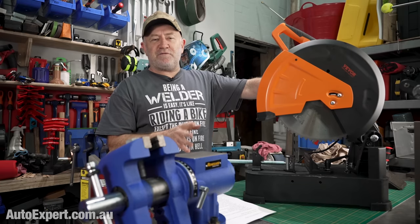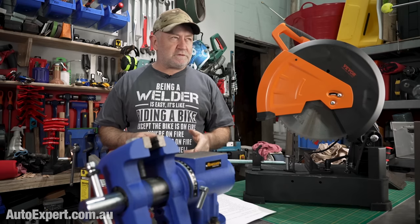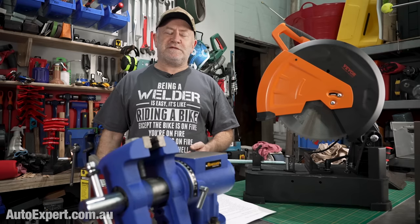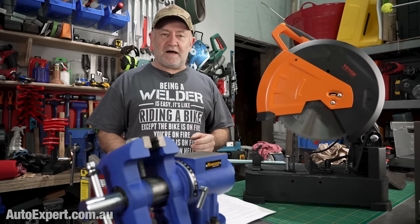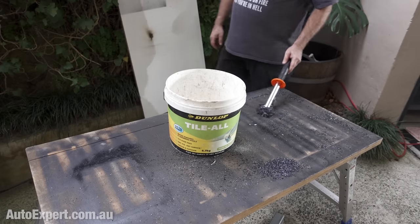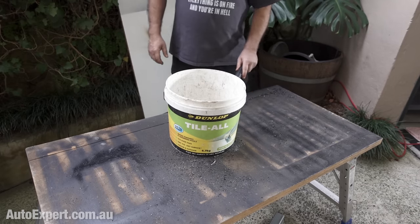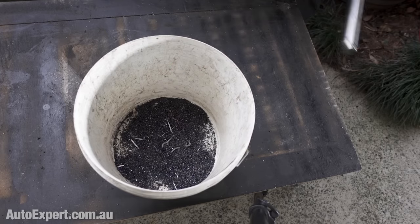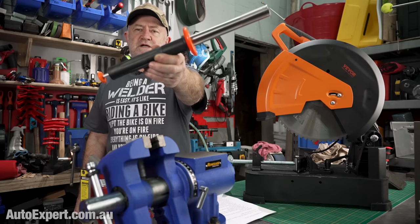When using a saw like this, the chips go everywhere. They're not exactly Satan's fingernails, but I'd be wearing safety boots, safety specs, hearing protection, and long pants that go over the tops of the boots — otherwise your feet fill up with sharp metal chips, and that's not fun. A swarf wand — basically a magnet on a stick with an on/off plunger — makes cleanup of the bulk of the material really simple. It's not just useful for cutting, it's useful for drilling and all that kind of stuff. They sell for about $40 or $50 and they're a brilliant tool to have around for general shop cleanup.